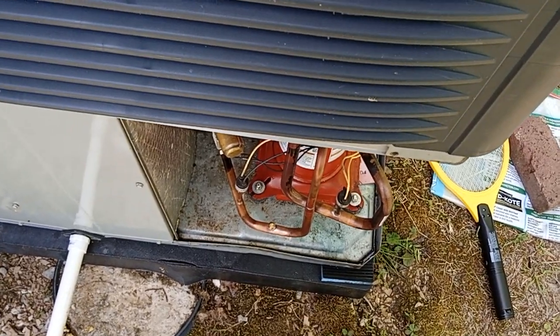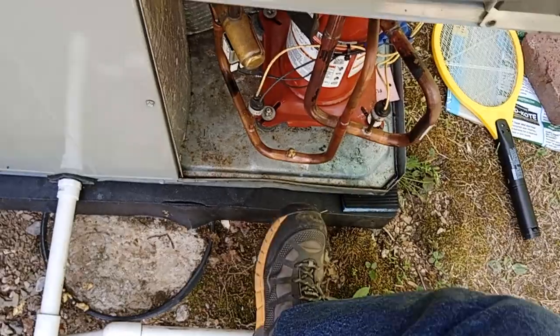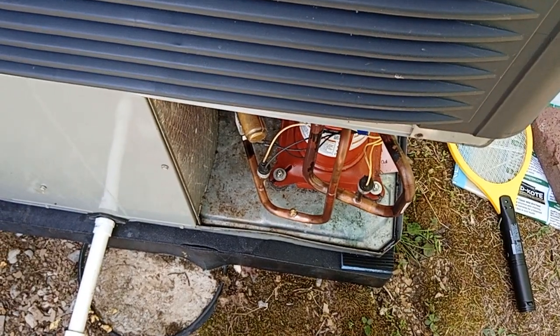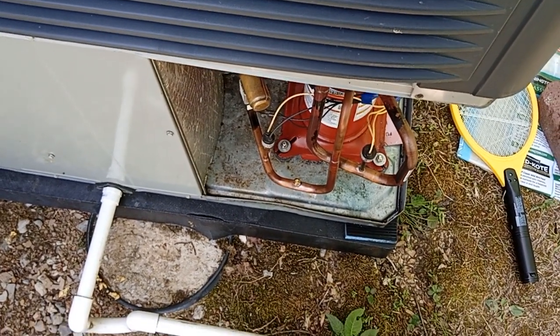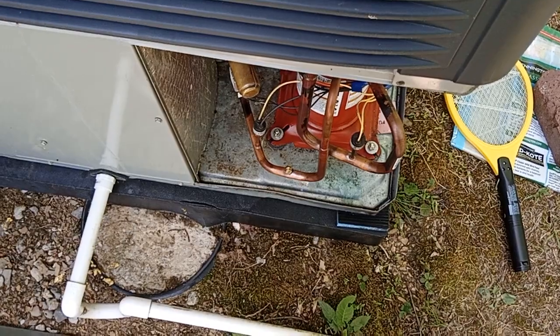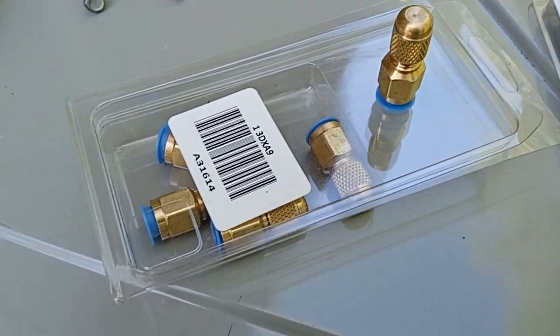And there's the answer. To get this brass cap off with a minimum of refrigerant and oil loss, I need to start the system up, run it in cool till the pressure drops and the cutout opens, and that means that the pressure on that port is 50 instead of 215. Then I can unscrew the cap and then I can put this on.